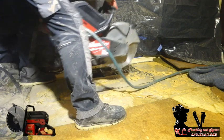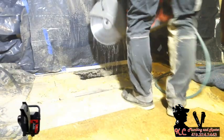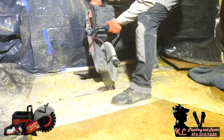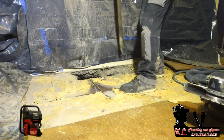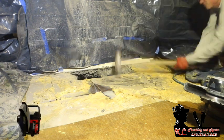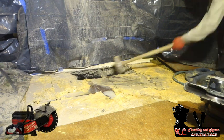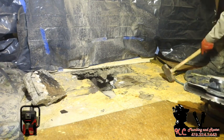All in all, it worked out really well to cycle between three batteries. I had no problem cutting open the little opening that we needed to get in there. Basically, once I cut open the slab of cement, pull out the chunks of cement, dig out the stone to get to the sewer line, then I can push through a cable. On the other end of the cable is outside the house with the machine that pulls the cable through and pulls the pipe in place.